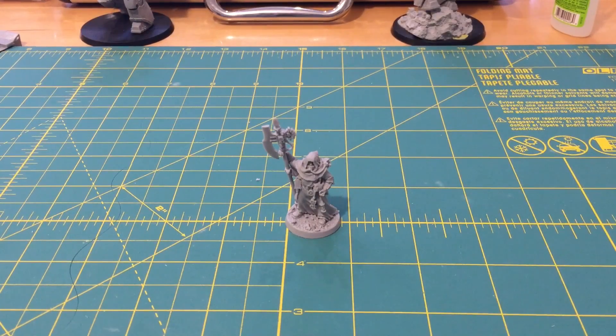Fans of the Horus Heresy, thank you for joining me for a quick video about shrinkage. This follows on from my series about the Triaros armored conveyor, where I had a problem with the hull size — one of the parts was out of size with the rest of the kit. I talked about how there are three stages of mold production before we get from the master model through to a production mold at Forgeworld, and if Forgeworld don't make things in sequence, parts are going to be mismatched in size.